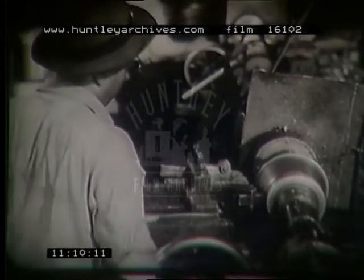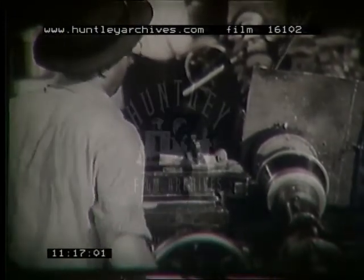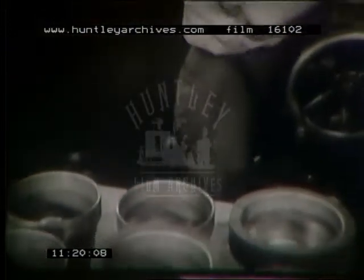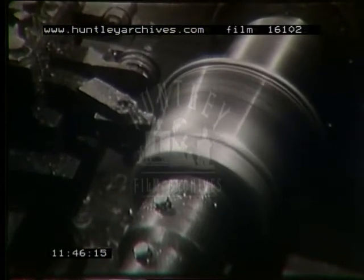Here is still another type of spinning, called shoe spinning or burnishing. The shells have been drawn to the desired shape in 2 or more draws. The drawing operations have left the surface of the shells slightly ridged and roughened, as seen here in magnification. Slipped over a polished steel chuck, the shell is held in place while being trimmed, beaded, and then burnished by pressing against it a hardened steel burnishing shoe with a highly polished surface. Burnishing produces a uniform, smooth surface. The operation reduces the thickness of the metal slightly and increases the depth of the shell very slightly, for which allowances must be made in the draws.